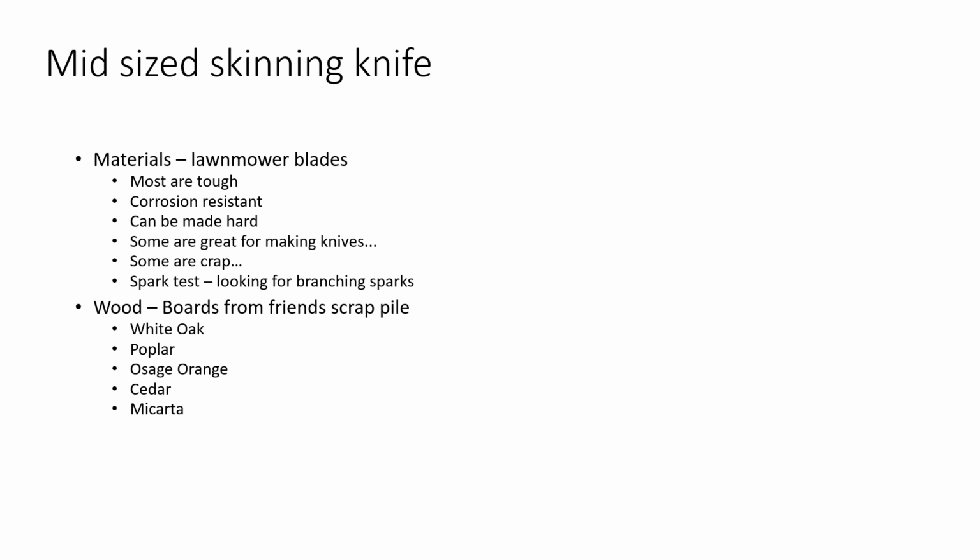And then I've got some micarta that I made. Made it out of black and gray felt that I bought at Walmart. Put it together with a little bit of fiberglass Bondo resin, and works pretty good. I figured up that for about $50 worth of material, you can make about $40 worth of micarta and lose most of the hair off of your fingers, knuckles, and parts of your forearms trying to get the glue off of you when you're done. Having said that, I've also done some really interesting stuff using different colored burlaps. I made a really wicked one out of green burlap, and I made a WVU Mountaineer themed blue and gold handle out of blue and gold burlap micarta. So you can do some cool stuff with it.